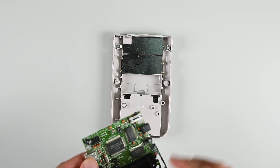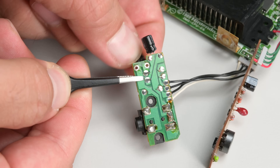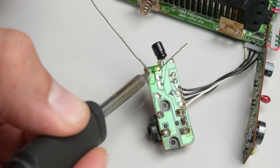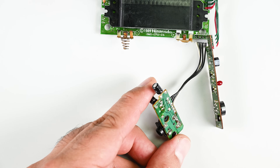That means more Phillips screws. Luckily all of these screws are the same length, so don't worry about sorting them. Replacing the through-hole caps is a simple matter of desoldering the old caps and popping in a new one of the same value. With any luck, replacing the caps should get your system working again. If not, you might need to look at other advanced repairs, which is beyond the scope of this video.